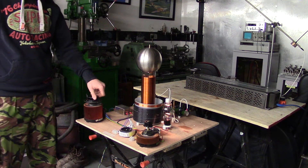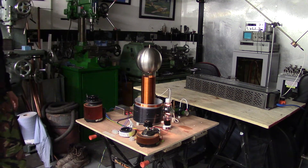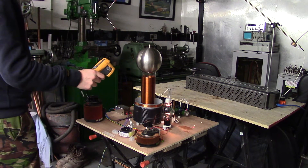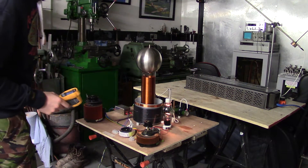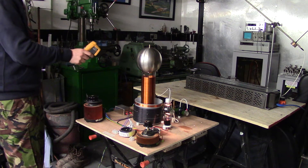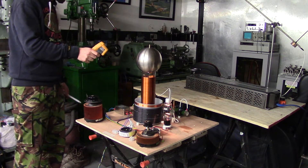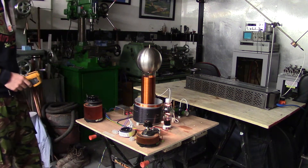It's a very hot arc — you can feel the heat off this. Nothing's really getting too warm though. Most of the heat is obviously the vacuum tube — that's running quite high, a couple of hundred degrees at the moment. The MOT is about 22 degrees but hasn't run for very long. The grid leak resistor is about 40 to 45 degrees — that's a 180 watt one I put in there.